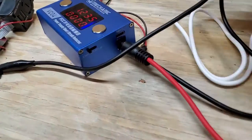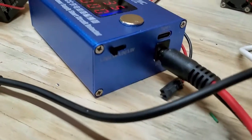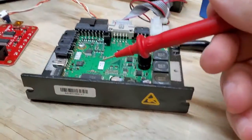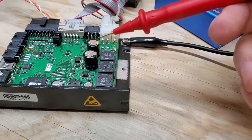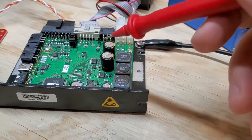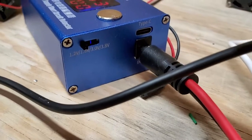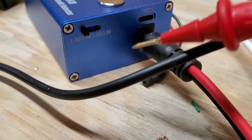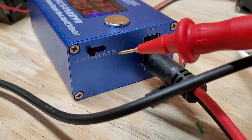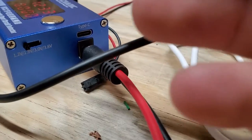This thing has three or four voltage settings: 1.2, 1.8, 3.0, and 3.8 volts. The reason you have different voltages is because you have different power rails on your board. You'll have one power rail that powers your microcontroller, which will be your lowest voltage, and you'll have a power rail for things like your motor drivers or motor switches, and those are going to be your higher voltages. What you always want to do is inject the voltage that's just under what the rail is rated for.